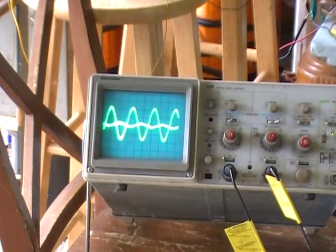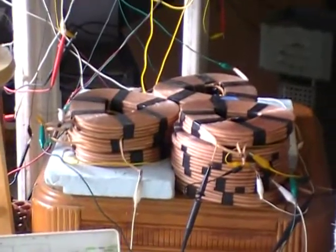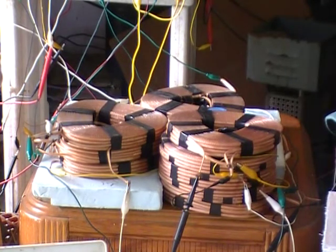Now, more importantly, we're going to change a few more things. We're going to take that dual channel observation and we're going to compare the strong pole, its phasing in time, with regard to the other strong pole's phasings in time. And to do this, we're going to take the coil now recording the weak pole on phase 3. We're going to move that to the strong pole upward facing on phase 1 and phase 2.